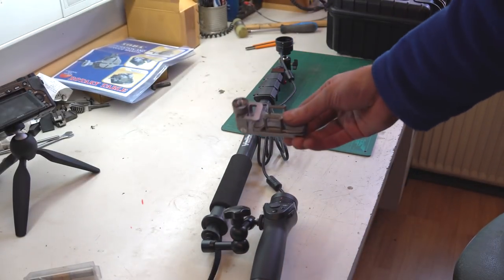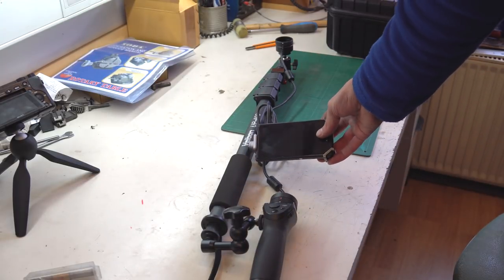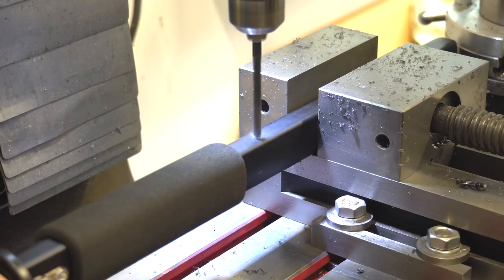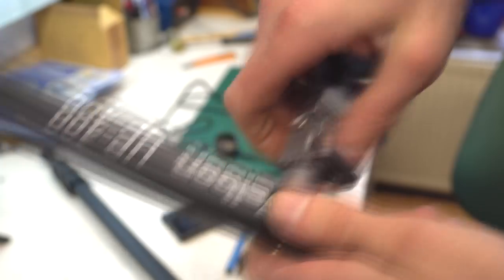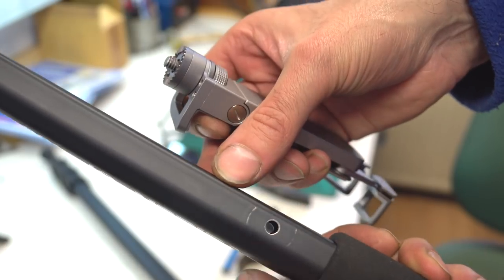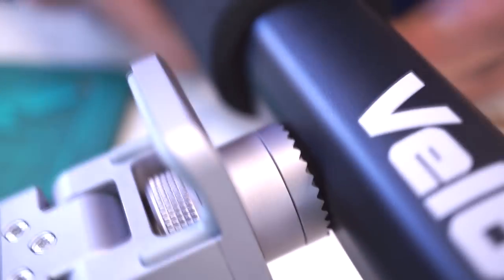After that I was left without a phone holder. Let's say that I want to have one somewhere there — that means I need another thread. I don't want to make another holder so I disassemble the monopod and make an M6 thread through the leg, so the holder can be mounted on the left or right side. But there remain scratches, so I make a thin plastic washer so the teeth still grip on the Osmo handle but don't touch and scratch the surface.